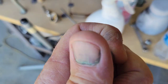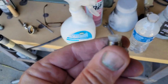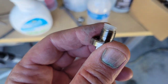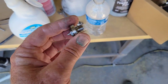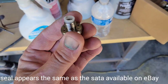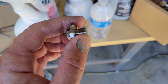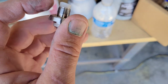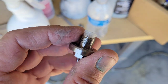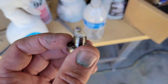I'm doing something I probably shouldn't be doing — switching it back and forth. It does have a little seal in here and they don't have an extra one in the package. I wanted to try it in primer and then in paint, but I would recommend if you're going to buy one of these, buy two — have one for primer and one for paint. Switching the seal back and forth is going to make it wear out, and I'm not sure where they're available, so keep that in mind.